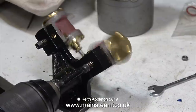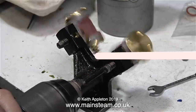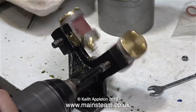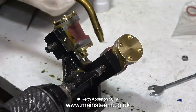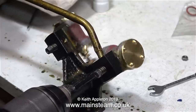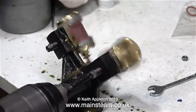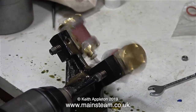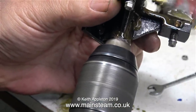After running the engine quite slowly for quite a while, I increase the speed. Here the speed is quite ridiculous, but it's rotating very freely and nothing's dropped off it yet. It's surprisingly smooth in operation. During these initial tests, I stopped the engine frequently and flooded it with oil, and once again injected some more oil into the inlet ports. As I run the engine slowly, you can see the oil being pumped out of the port at the other side underneath. The oil being pumped through the cylinders is coming out quite clean. The dirty black oil on the bench is what's spinning off from the big ends, and I would expect this on a brand new engine that's running in. I'm surprised how free running this engine is — when I lift it up into the air off the soundboard, it's almost silent.